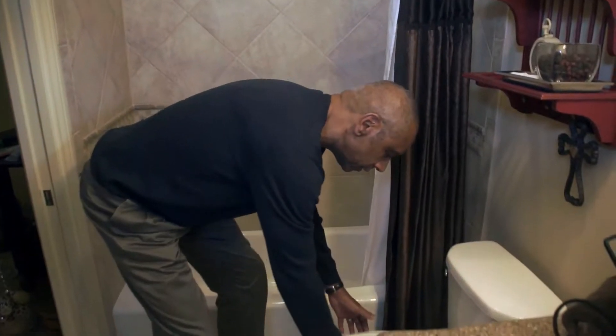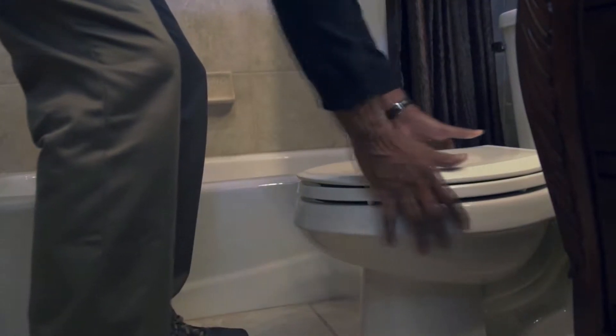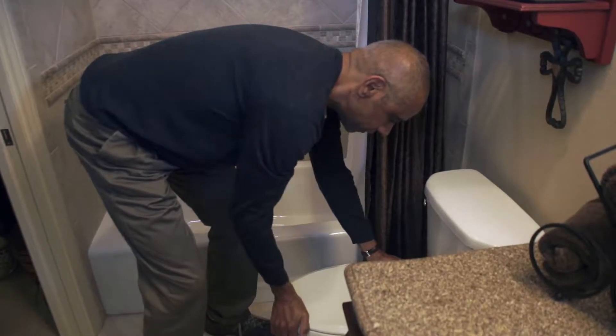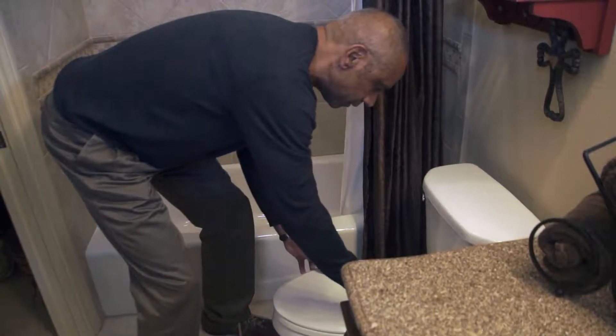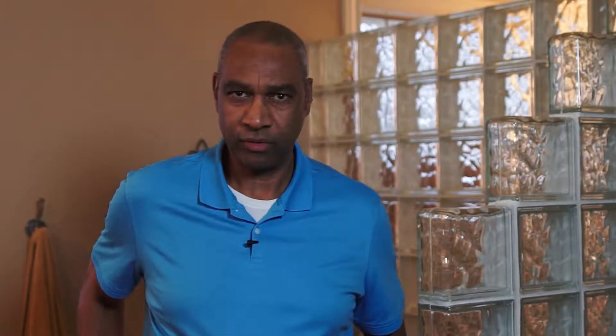Before you begin, here's a simple way to ensure your toilet is seating on a level floor. You'll want to grasp both sides of the toilet and gently rock right to left, then shift your hands to the front to back and gently rock again. If the toilet doesn't move, your toilet will be generally level. If it does move, use plastic shims which you can get at any local home improvement store. Wedge the shim between the floor and toilet until you no longer notice a rocking.